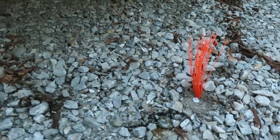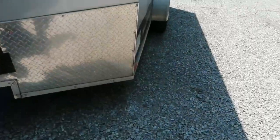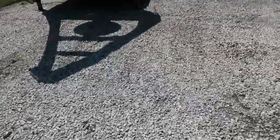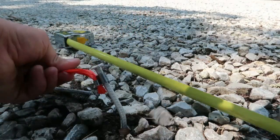The hardest part of this project is honestly measuring out where these need to go. Along the fence here, we went 12 feet off the fence, with the markers spaced every 20 feet. This section was pretty easy to put the spikes in — we did have one that wanted to bend on us, but other than that they all went in fairly easily. In the employee parking area, we've got two markers going in the middle to mark the beginning and end of the parking line.